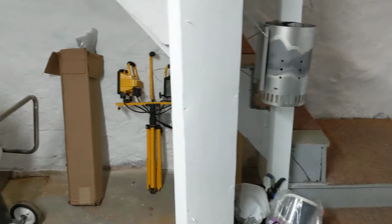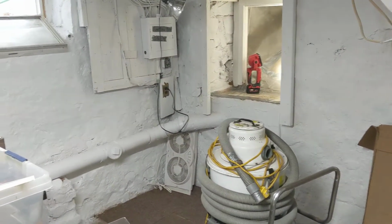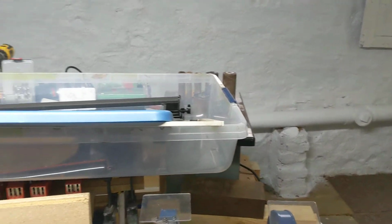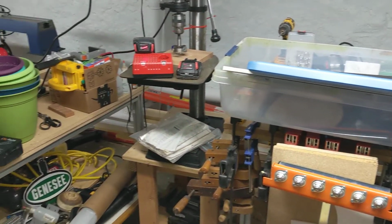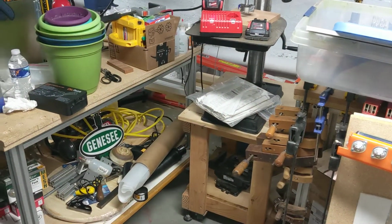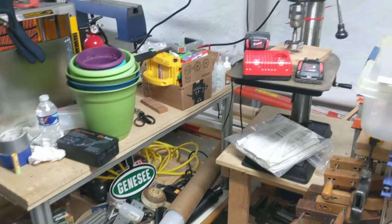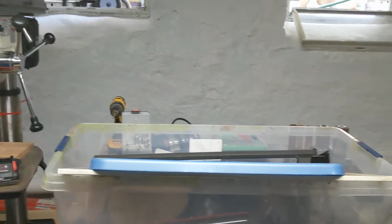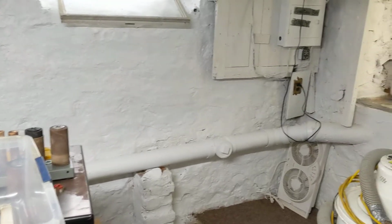So in this case, every item and every wall, every floor joist, every piece of decking, all gets HEPA vacuumed and sanitized with an antimicrobial. And I'll go across the whole basement here in a second so you can see how much stuff is in this basement that we had to go through and decontaminate. This will all prevent mold from coming back in the future, and it'll also prevent any cross-contamination into the rest of the house as the homeowners walk in and out and do their thing.